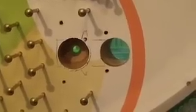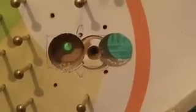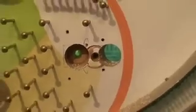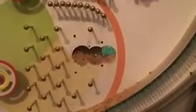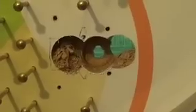Now I'm gonna try to put a 5/8 inch hole right between the two holes, then I won't have so much to dremel out later. Third hole starting right there, starting to go through the formica. Third hole starting to come through now, a little back action. Almost through — there's just a little piece there, so I think I'll dremel that so I can control the falling of the flex.